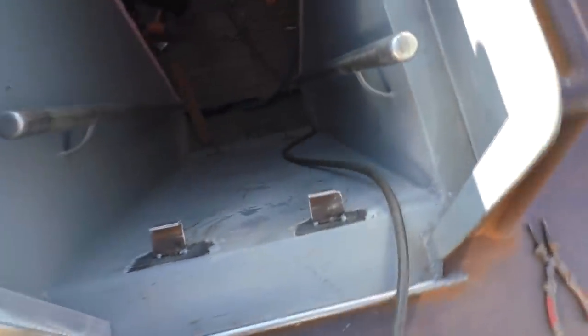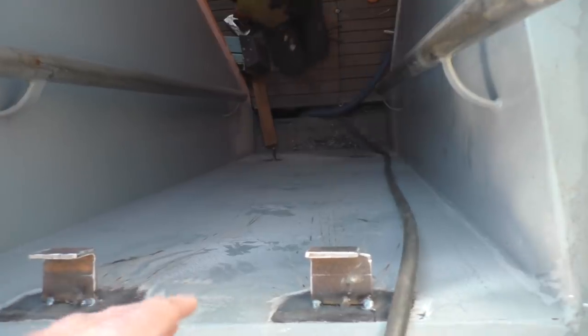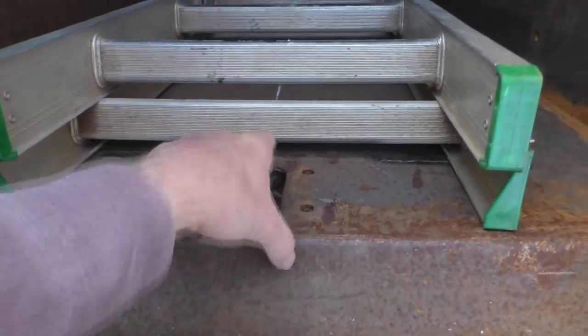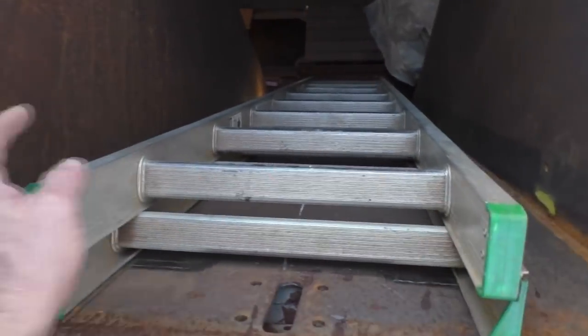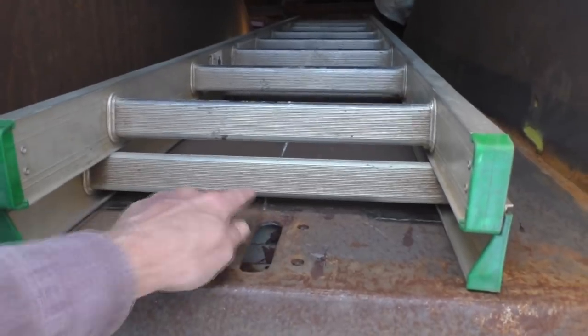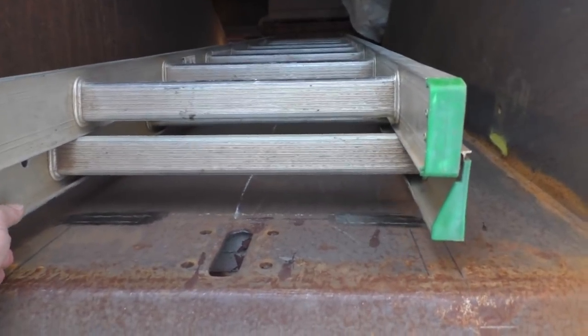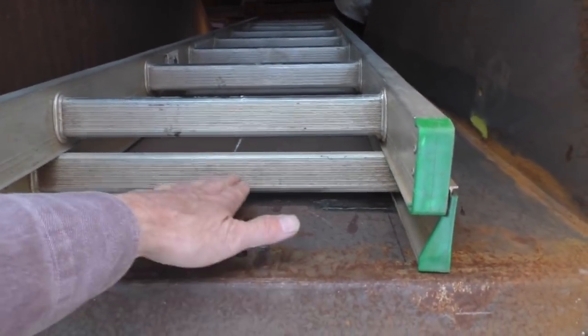Okay, here's the difference. This ladder up here is going to sit flush to this steel, because if we do a carrier or some kind of lift system in here, it's gonna have to be built so it can be lifted from both sides, not from the center. That forward one's different. This one we're gonna try using the lift system that we've already built into it. There's a winch and a pulley here, so a cable that runs down, but it runs right down the middle. So there's a slide on this side and a slide on this, so they gotta be tied together. And it has to be something that this cable can attach to, so they have to have a piece of steel behind the ladder that goes across. So we're gonna wedge this ladder out 1 inch. And so that way these carriers will go down with a plate of steel behind the ladder.